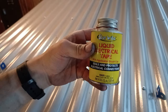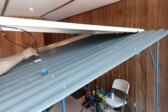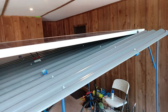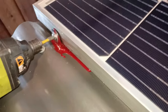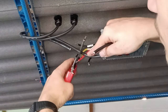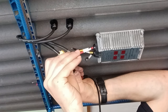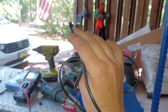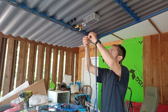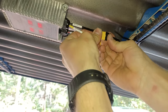I'll be using some liquid electric tape to seal all the gaps. Next, we'll push the wires through the cable gland, lay down the solar panel, and then finally screw it down. The final thing to do is the wiring. While the solar panel came with connectors, I still had to chop it in order to get it to fit through the cable glands, and replace it with XT60 connectors. For the cable going to the battery, I'll be using some 18-gauge speaker cable and zip tie it to the frame. Now we'll just hook up all the connectors and we're done.